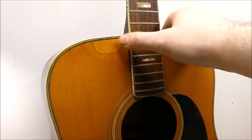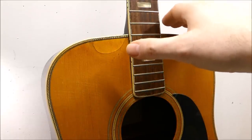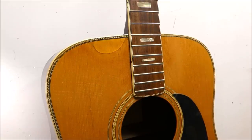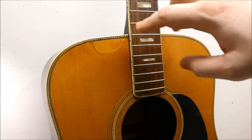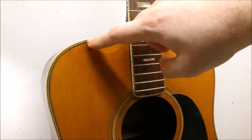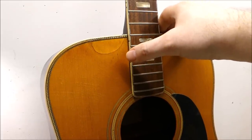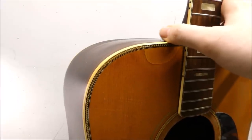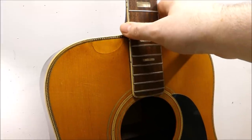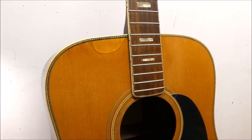This new piece is going to darken over the next few years as well. I've seen some repairs where people didn't take that into account and the patch ends up way darker than the original. There are ways of getting around that — you could expose it in a UV box for several days and that will naturally darken the wood. I just don't have time for that, or the space, to be honest. The herringbone is kind of similar, but mine ended up looking a little more like the modern stuff than I intended. In retrospect, the white lines in the original seem to be smaller than the black — it's slightly thinner. I could have sat there for five hours trying to thin each of those lines out by hand, but I've got other jobs to do as well. And I am happy that I managed to get that big dent out of the side — it's pretty smooth. Still got to put a couple coats of lacquer on this and let it sit for a week or so before buffing it up, but I think we'll end it here for now. Thanks for watching, stay safe, and we'll see you again soon.